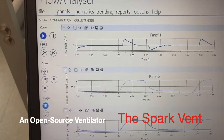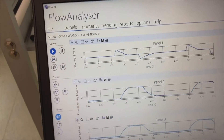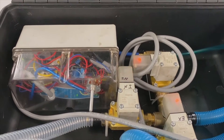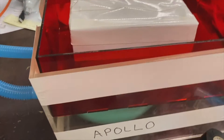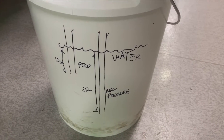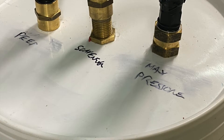What you're looking at here is a trace of the actual output of the ventilator, looking at flow, volume, and pressure. Over here you can see the test lung inflating and deflating. Moving across here is our set-up valves. We've essentially got three valves: inspiratory, expiratory, and a mix valve with the electronics that control it. This is a very simple bellows made out of an anaesthetic bag with just a weight to collapse it. Down here we have a bucket of water, which is how you set the maximum inspiratory pressure and the PEEP, just using a pipe inside a column of water. On top here you can see the port that we've made so you can scavenge the gases and any virus particles.